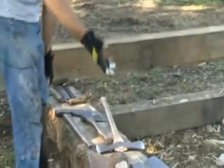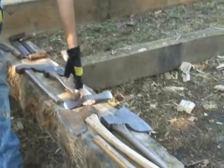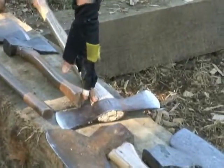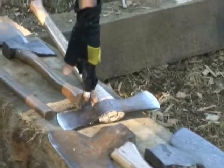These are the tools of the trade. Typically we'll start off with a double bit axe to square the log down to our rough dimensions and make the cross cuts in the grain to make it easier to hew.